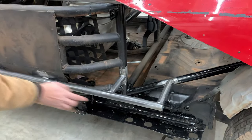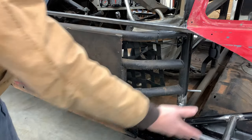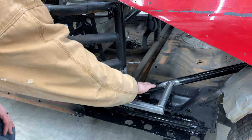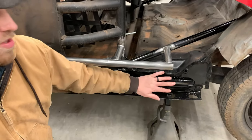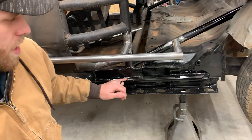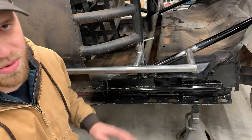So we got Stage Fright looking great. Got all the doors bent up, got everything fitted — we're pretty much done with that at this point. We added the door bar that goes down the length of the door. It wasn't there before, and every time we got hit in the back or up front it would just kind of fold everything in. Added this bar right here, added this bar to support the door bar, and then added the bars to the back of the chassis like we did on the other side. Feeling really good about the car now. I know someone's going to say something in the comment section — I added this bar to tie the back of the cage to the chassis itself. I know there's different ways you could have done this. You could have used flat steel, you could have used 1x2 tubing, but this is really all we had. I didn't want to go buy a whole stick of tubing just to do this little part, so I did it this way and that's all right.